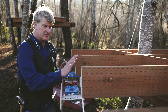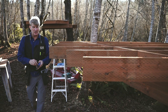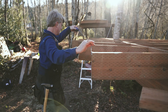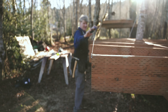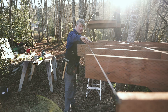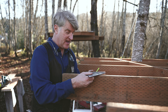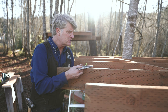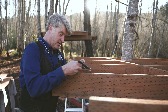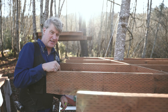I've made that last cut. We're going to have one rim joist go to this joist, and then I'm going to go from this point to the far point with my chalk line. We'll just make this a straight cut all the way through — make sure you get some good chalk on there, and just one good snap. We've got our chalk line now, so I'm going to do the same process with my speed square to understand the angle I'm going to need to cut. Here it shows about 24 degrees, so I'm going to put a 24-degree angle on the table of my circular saw, first make the mark on the side I'm going to cut, then come back with the ladder, make that cut, and we'll work our way down the line.